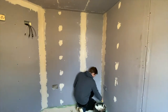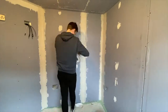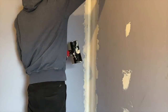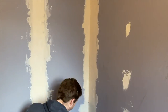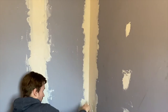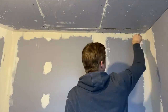For that reason, tape and jointing works well on walls where you can hang plasterboard vertically and the walls are not higher than 2.4 meters, which is the standard length of plasterboard. But if you've got taller walls or large ceilings then the full skim option is probably better. Also note that tapered edge plasterboard is marginally more expensive than square edge, so just something to bear in mind if you're doing a large room.